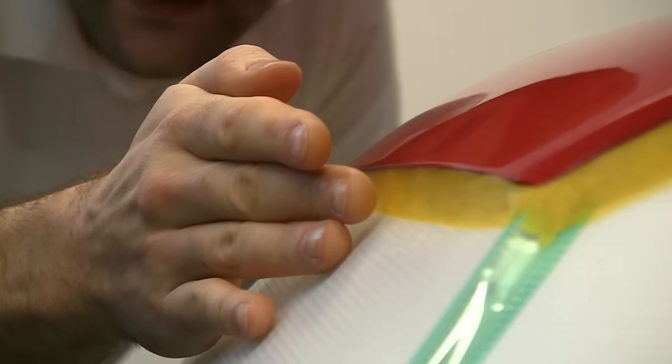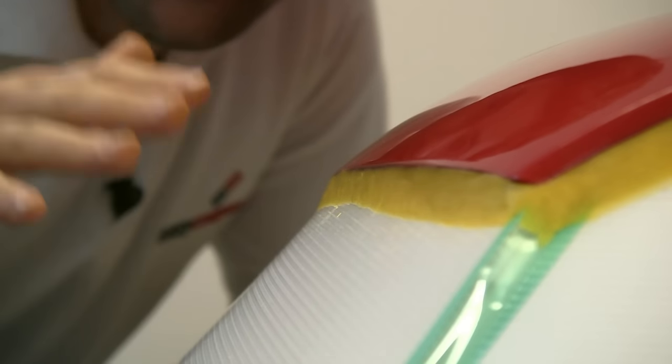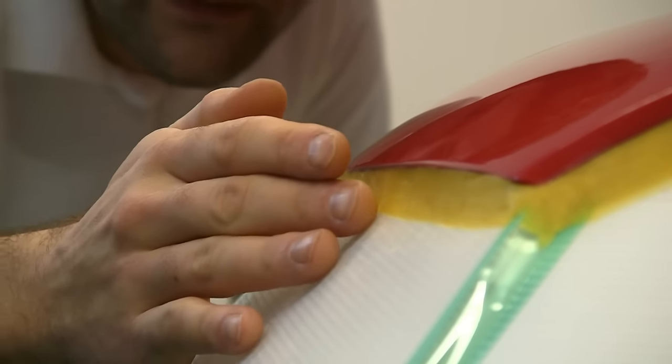And you can see from this close-up that what we want to do is always be sure that when you put the wax down, you've got what's called a draft angle. And that's going to mean that when we remove the part, or separate the part and the mould, there's not going to be a mechanical lock.